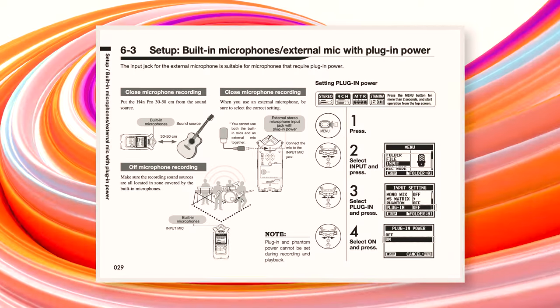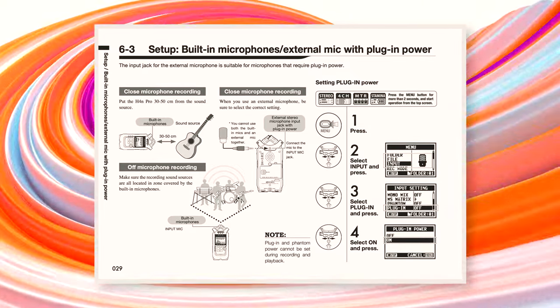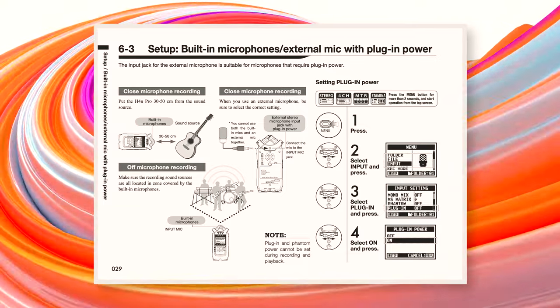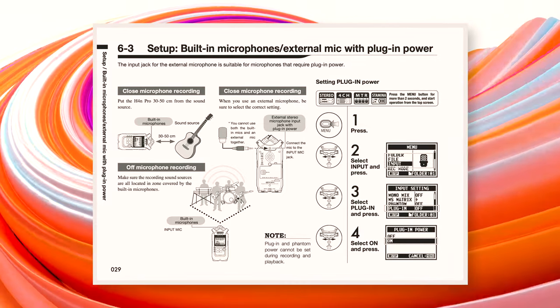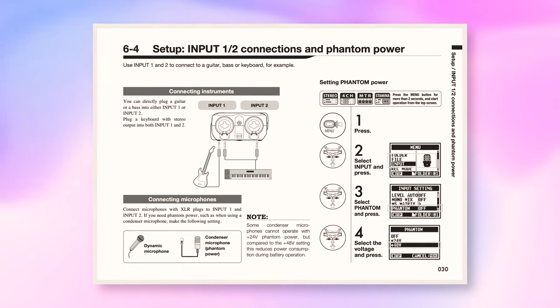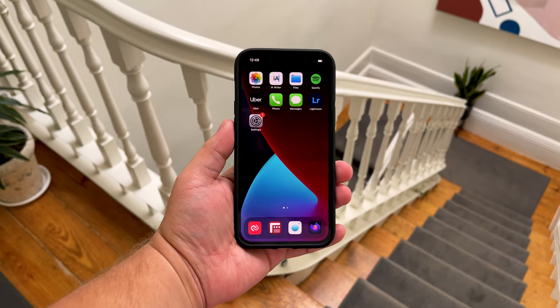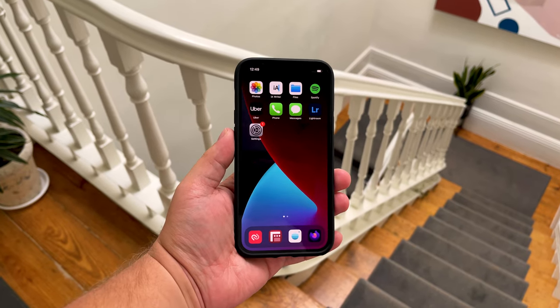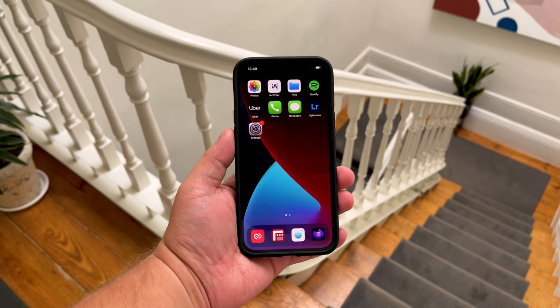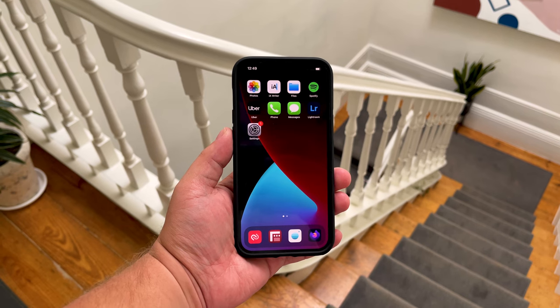This is great if you need to plug in a lav mic to record dialogue. Bear in mind that your lav microphone might require 2.5V plug-in power, which the H4n Pro can provide. This can be done by going into Menu, Input, Plug-in Power, and then selecting On. The same applies to phantom power if you're using a condenser microphone which needs it. If you have a smartphone lavalier microphone, chances are it has a TRRS plug, which will not work with this recorder — getting a TRRS to TRS adapter should do the trick though.